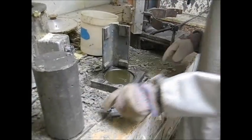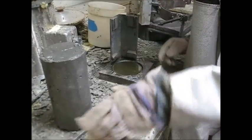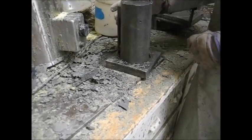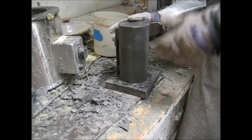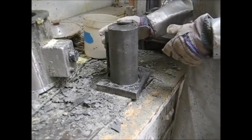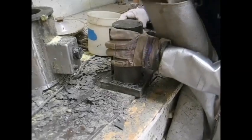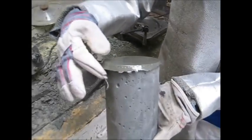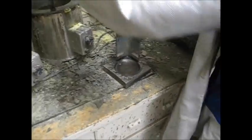We had a little hardened piece of sulfur fall in there. So you're going to want to flip that out using another chip of sulfur, brush off the bottom this time, and lower it down. If you don't want to risk doing that, you can just let the sulfur harden in the mold and hammer it out. And if something goes wrong with the capping, you can always break it off and try again. You're going to look and wait for the sulfur to harden all around the cylinder, then lift up. You should get something pretty smooth. It's okay if something breaks off near the end, so long as it doesn't break into the cylinder.